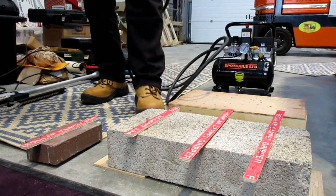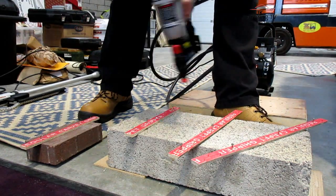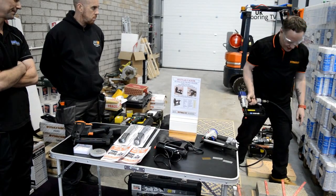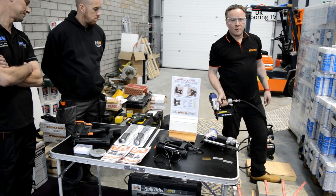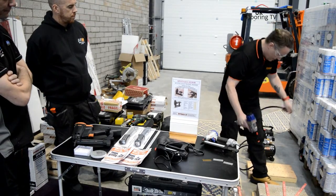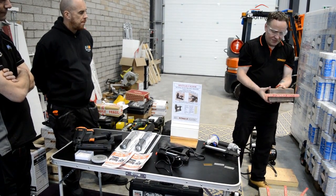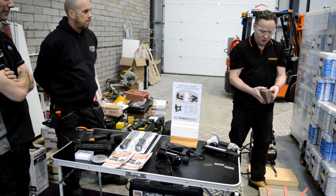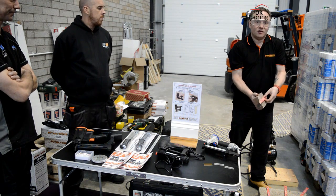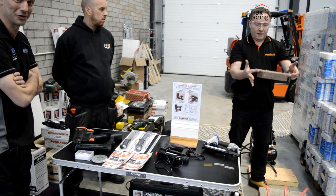You can hit that with a hammer — it won't come out. It's stuck. You can't pull that up at all. If you have a longer bit of gripper, you can put it across there, put just three nails in — one in the middle and two either side — and you can actually lift that concrete block up. Bear in mind, this isn't a breeze block, it's a proper concrete block. And just to explain, this is an engineering brick, one of the more solid bricks you can get. And it's in there — it's not coming out. We've all tried to knock a nail into a brick laid in a house and you're not doing it, are you?